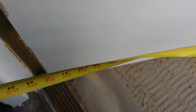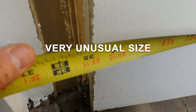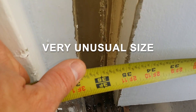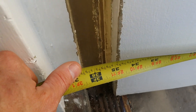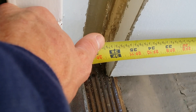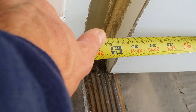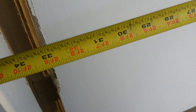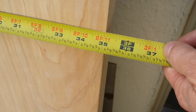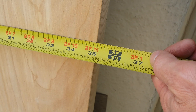So check your measurements. This door is just under 35 inches. You could order a 36-inch door, but then you'd have to cut off a half inch on each side — that's a lot of work and that can screw up a door. Since the door has to be ordered special anyway, just order it as 35 inches. My new doors are 35, so there will be very little shaving involved. It saves a lot of time and energy.